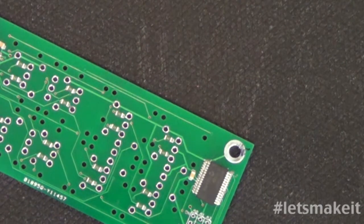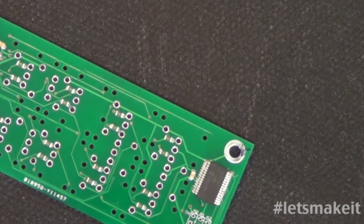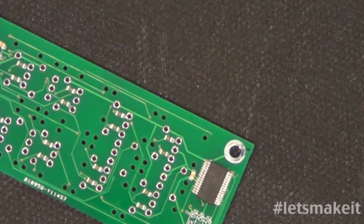Now the other thing I mentioned we should have around for tools is paper towels. First of all, the tip of that syringe does get a little gunky sometimes, so it's good to clean it off so you get a nice clean tip. But also things to set it down on, like you noticed I came back and got it. It's because it's sitting next to me, and I set it on paper towels so I didn't get it on the table. It's also nice that if you mess up with one of these, you just wipe it off and put it back on again. So I might have one of the chips that has a little bit too much on it, but it'd be a good example of what happens whenever it jumps.